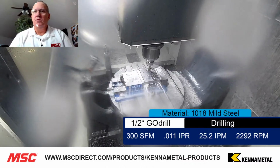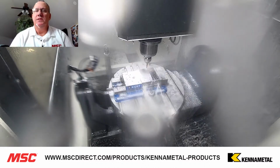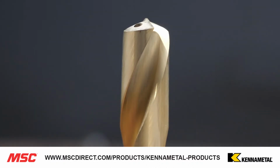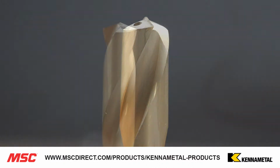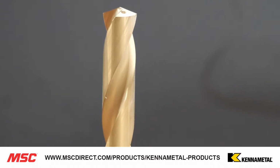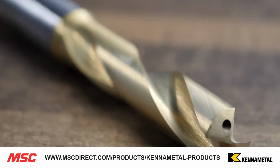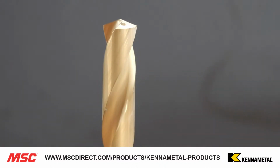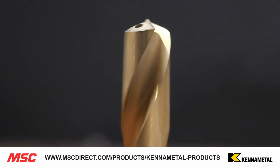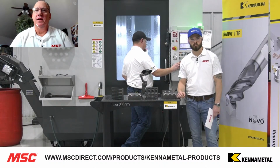The GOdrill is a general purpose drill. It starts out at roughly 39 thousandths in diameter and goes up to nearly 800 thousandths in diameter. It is a solid carbide drill, so it's economical. It's our economical line, so you could have these sitting around in your shop as well over a high-speed steel drill. It does have some technology in this particular drill. The TiN coating that you see there helps provide longer tool life. So there are some advantages. As you can watch, this one drills much faster than the high-speed steel drill, and it definitely pays for itself. The return on the investment is pretty quick.